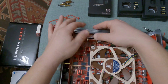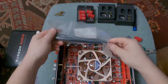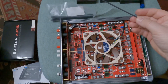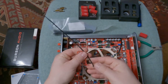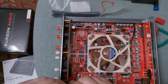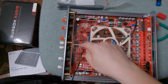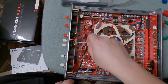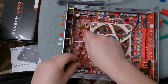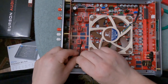However, during transportation of the amplifier you never know what might happen inside, so adding extra protection with nylon ties is totally recommended. I couldn't find red ones, so I'm going to use black ones — same thickness and width. I'll use the same wire cutter to trim the extra length. Ties should be inserted under the DIP-8 sockets, then tied tightly around each op-amp.